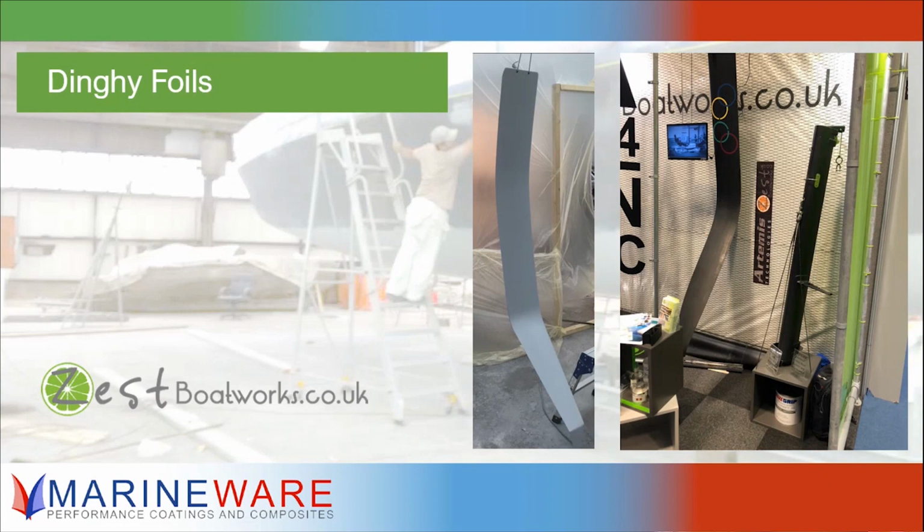And Chris, this is one of your foils next door to us. The grey one in the picture in front of us is out of an A-class. That's out of an A-class as well. Okay. What have you got on that one? You've got clear coat on that carbon foil there, haven't you, Pete? Yes, we're limited by the class rules as to what we can put on the 17 foils. Of course. And is it just primer on that foil, Chris? Yeah, in that photo it's just primer. I can't remember whether we cleared it afterwards or whether it was left. I think it just got rubbed back to about 1,000 grit and left at that.